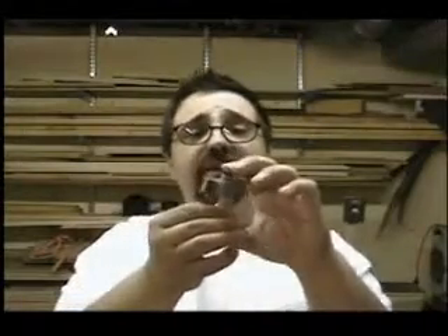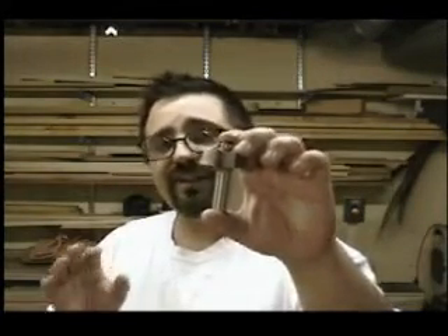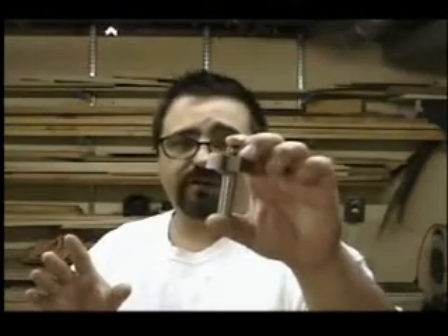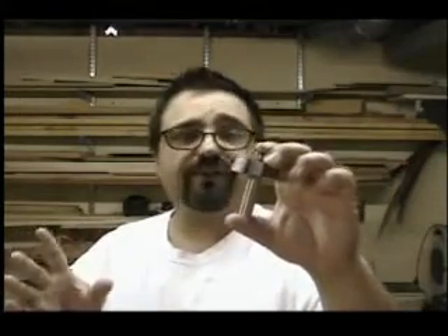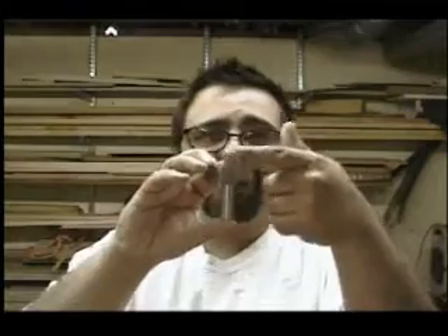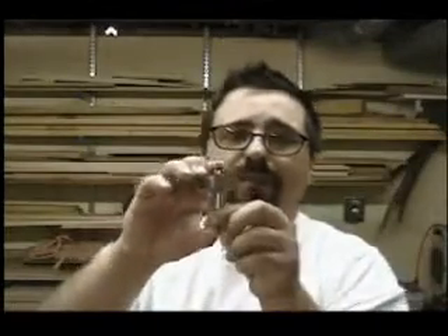This baby is really, really heavy. As we've come to expect from Whiteside Machine Company, these are carbide-tipped cutters — and there are some pretty thick pieces of carbide on here. With it being carbide-tipped, it's going to be quite a while before we need to worry about sharpening. And given how much thickness there is, there's quite a long time before we'd ever have to think about replacing them, because there are quite a few sharpenings in there. Also, you can see the famous Whiteside bearing right at the top — these things just keep on spinning, even caked up with sawdust.